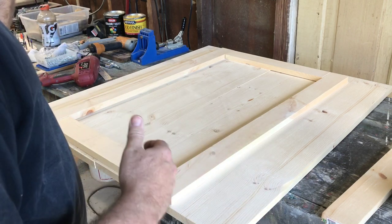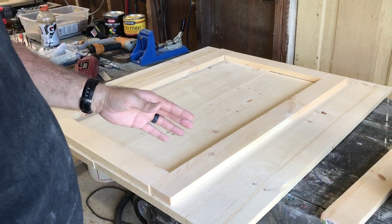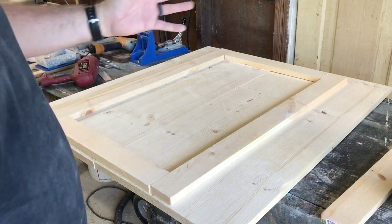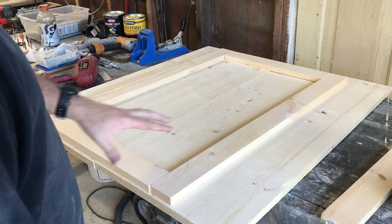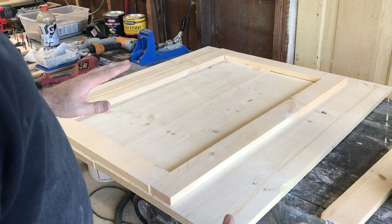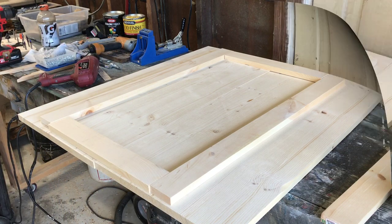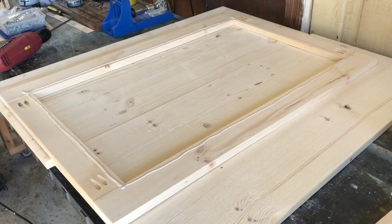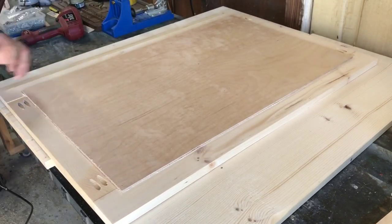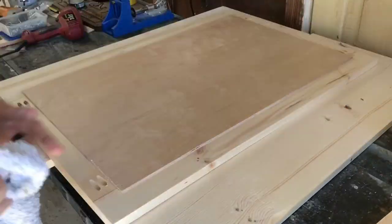For the trash can door I'm not going to bother cutting an inlay — this is really long at 33 and a half inches and my CNC only does about 31 or 32 inches. Plus, it's a trash can — I'm just gonna put that quarter-inch birch on the outside, shoot it, and be done with it. The trash can is gonna lean against the backside anyway. Let me get my pocket hole screws in and get the frame together.